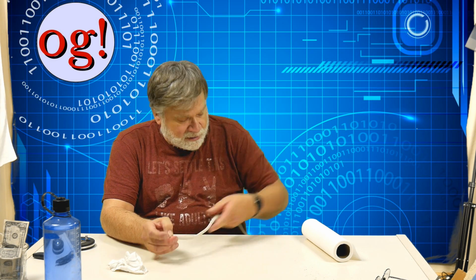It's not quite going to be enough, because if you add all that up, 19 times 3 is almost 60. But we're still going to need just a little bit more than that. Now, if you run the formula for the 40 meter band, which is 468 divided by the frequency in megahertz, that will give you the length in feet. I know that's not very metric, but that's the way it's been. It works out to about 66 feet. So this will give us just shy of 60 feet just from this one cable here, and then we'll pull some more cable from some of the other wires.